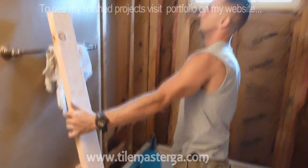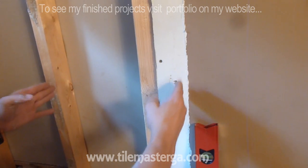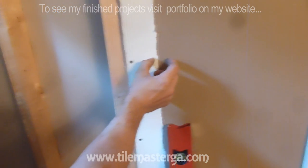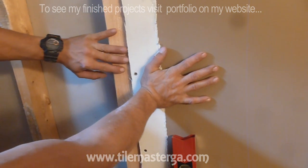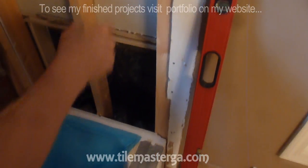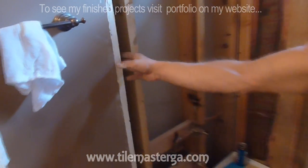Okay, so another thing, of course, we have to have blocks. On this side over here, of course, studs being separated by 16 inches, we not always tile all the way. So I have the drywall cut out with the edge of the tub, and the stud actually appears to be here. So in order to have a good transition from the drywall in the bathroom to our tile board, I added a block all the way from the bottom, and I will screw the tile board to this block. I did this on this side, and on the other side, there's no block present yet. I left that empty, and this is a piece of 2x4 that I'm hoping to slide over there and install.